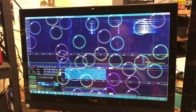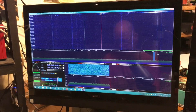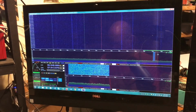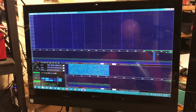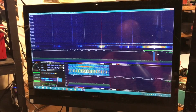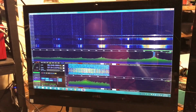So I think what I'm going to do now, do a 7 minute grind on each side. Interesting thing, when you assemble it, pressure on the crystal, all that good stuff when you get it back in the case. Frequency came down a little bit, but we are at about 7013.9, so 7014 essentially. I think I still have to adjust bias and whatnot to get a decent note out of it.